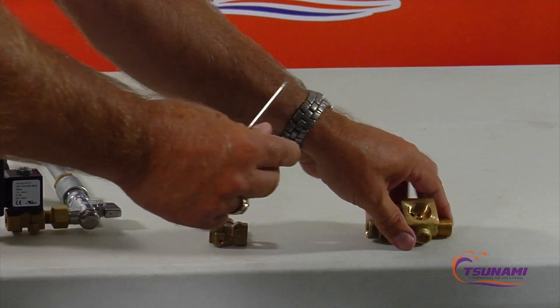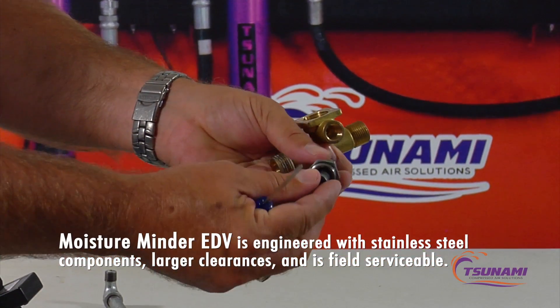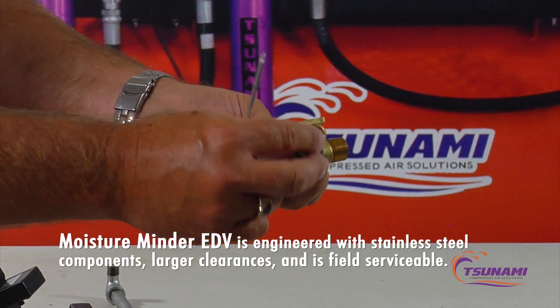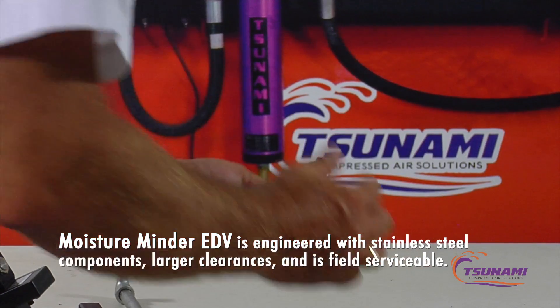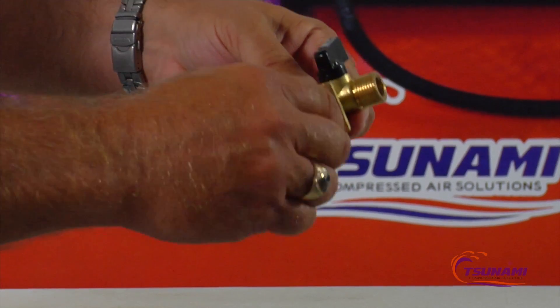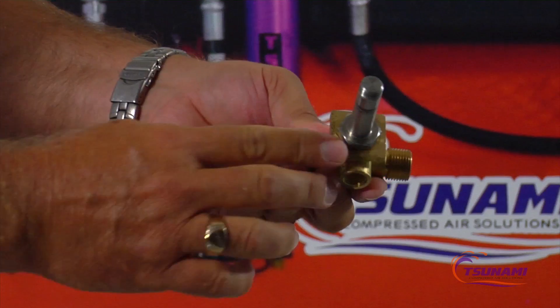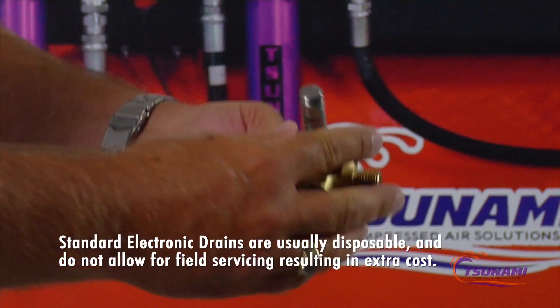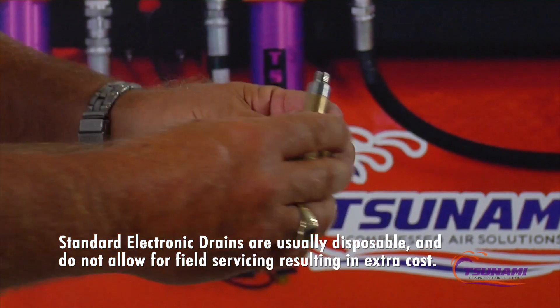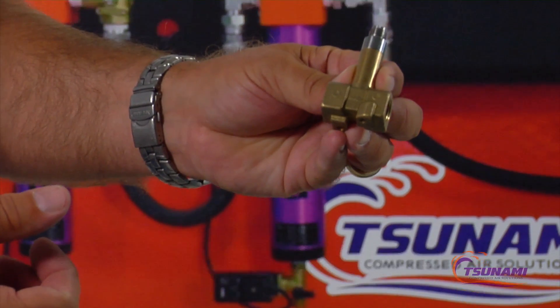With our design, we have a much larger assembly made entirely out of stainless steel, and we have much larger clearances on the plunger so we normally never worry about that. Also, if you ever do get debris in there, you can screw this plunger out and actually service the valve. In contrast, just about all other valves in the industry are made as one piece, so you'd have to throw the entire valve away and buy a new one.